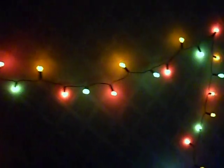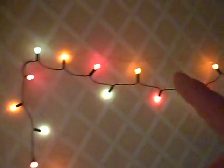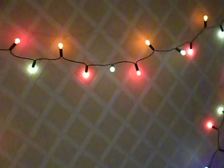This string of LED fairy lights actually started off as a set of tungsten fairy lights, but I modified it. I removed the glass filament lamps and put LEDs in instead, all in the correct polarity all the way around, then made a very small power supply. There's a bridge rectifier and four 10k resistors — one per LED strand — with the whole lot potted in resin. That means these LEDs are running at about 3 mA each, and the power consumption is again just under a watt. So that's just a few of my LED things.